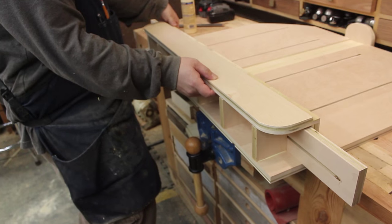That part was a little touchy. I had to attach the fence to the top of all those blocks and I had to make sure the face was perpendicular, but between the face and those blocks are the sliding fence extenders, and those had to be loose but not wobbly. I had to glue it all up and manage the glue squeeze out, but I managed.